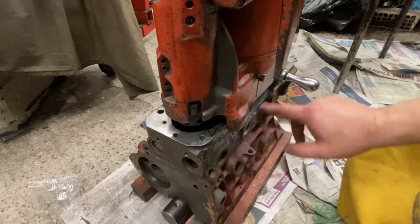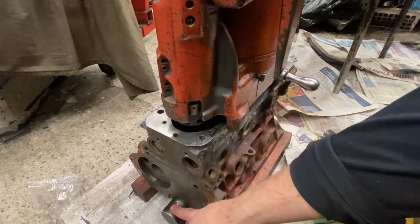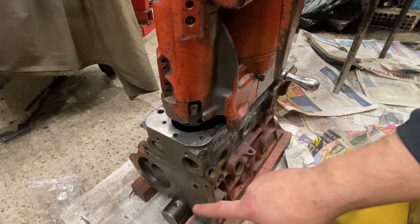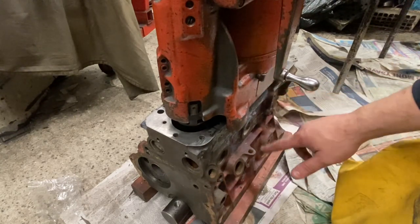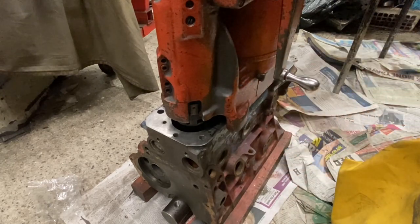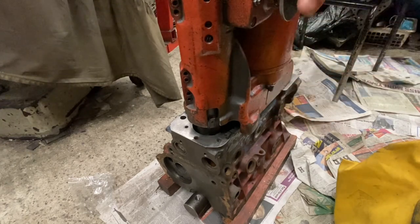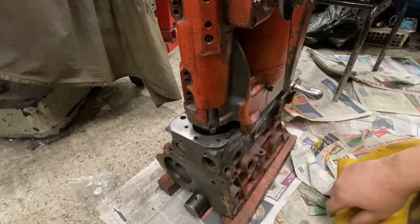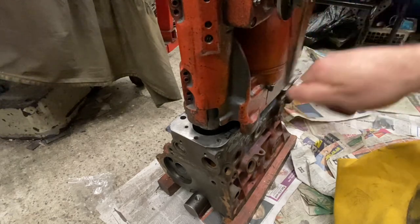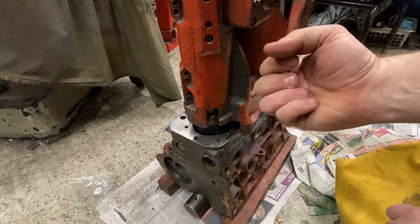In terms of our setup — there's the block and the boring machine mounted on top. We've got a clamping fixture with a non-standard anchor, which is a solid bar that goes all the way through the block. There's studding which runs down a cylinder into that bar, enabling the machine clamp to hold down to the block. By turning this handle the quill comes down and feeds into the block, so the next job is to center it and dial in the offset.